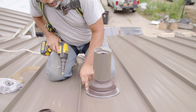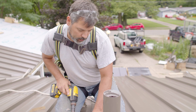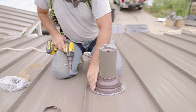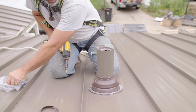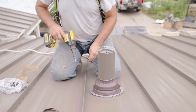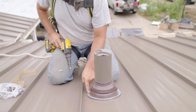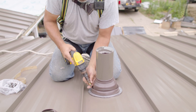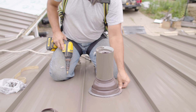You want to seat these fasteners down. Make sure you've got your butyl pushing out a little bit — seat these down so they're properly set. With your normal fasteners you don't want to overrun them or underrun them. You want to make sure that washer is set. If you go down too hard on these, you can shred the boot, tear it up, damage it. So you want to be real careful. You don't want your gun to kick off and tear through the side — you'd just have to get a new boot at that point.